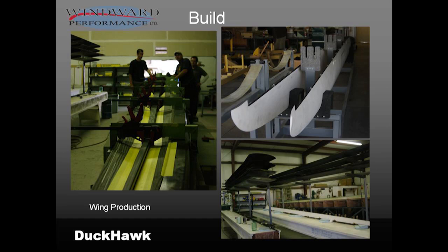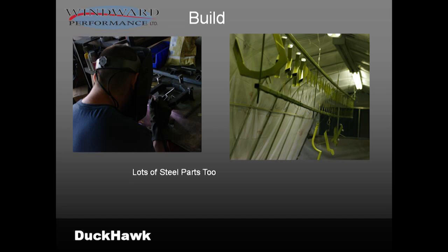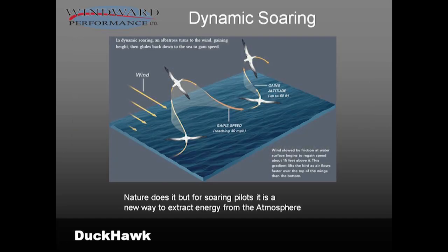None of the Sparrowhawk internals would fit inside the Duckhawk skins, so they all had to be remade — a terrible lot of extra work. Here are some wings coming together. Those wing skins for our next production airplanes are shown in the lower right — we're happy to be moving along that way. We tend to make almost everything in the plane: the tooling, the carbon lay-ups, the assembly, cutting and machining steel components, welding, and of course painting. We even make our own transparencies. Just an example of the great scope — many thousands of hours of labor.